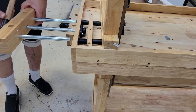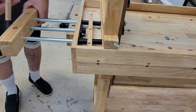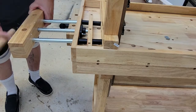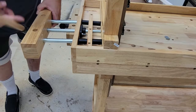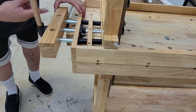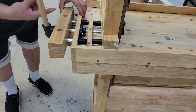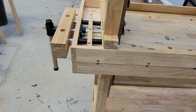We're using the vise handle until it gets to the 2 holes for the rods. Slide those in by lining them up and continue to slide it all the way in until you thread it across to the next section. There you'll put back in the set screw to make sure that you don't overextend this again. As you can see here, the holes are on the bottom and I have to take it back apart and do it again.